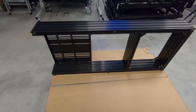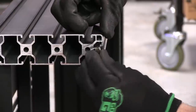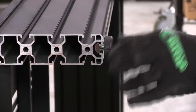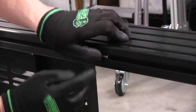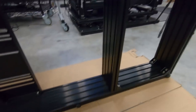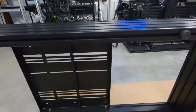The feet are installed now to the bottom of the Prime Cockpit. Pretty simple — on the ends I just slid the T-nut in from the end, and in the middle I did the push-in installation, maneuvering the T-nut to clip in with spring tension against the channel top, then installing the foot. Now that I've got everything tightened up — the pedal tray and the spreader supports — I'll flip it back down, get rid of the cardboard since we have the feet now, and get on with the next segment.